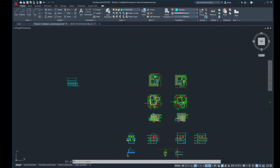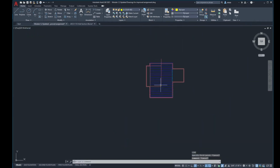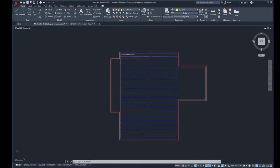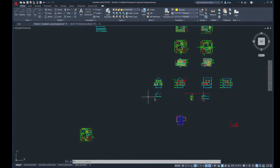So if you look at this in plan, my joists are running this way. Here, let me show you. Actually, I have a framing plan down here. My joists are running horizontally across that main mass of my building, right? So this opening here, these joists have to rest on something. Something has to carry those joists, and that is done in this case by a big LVL beam.